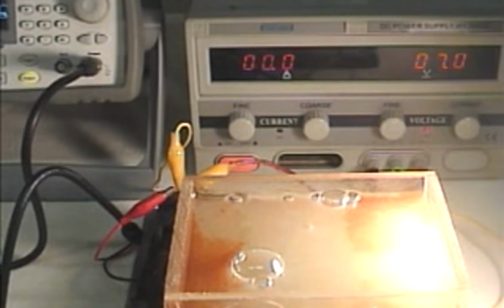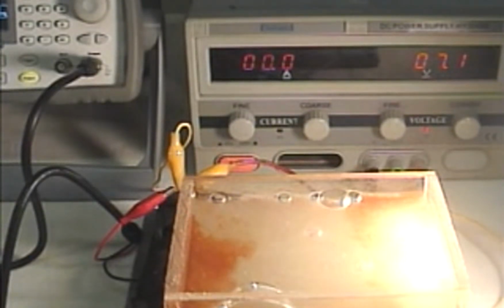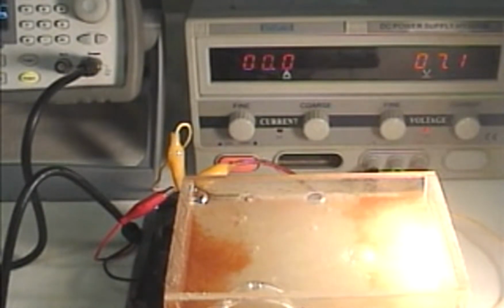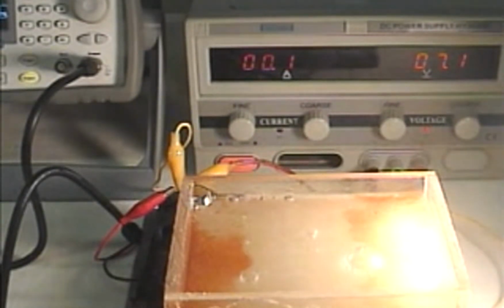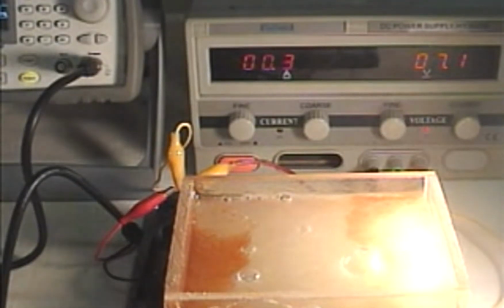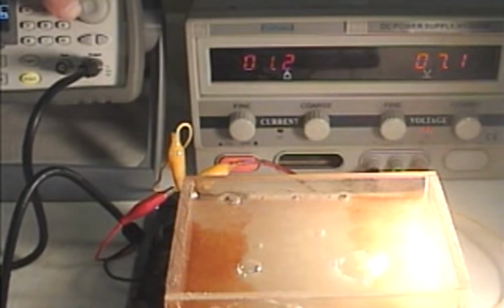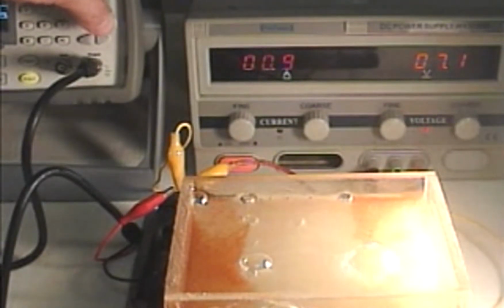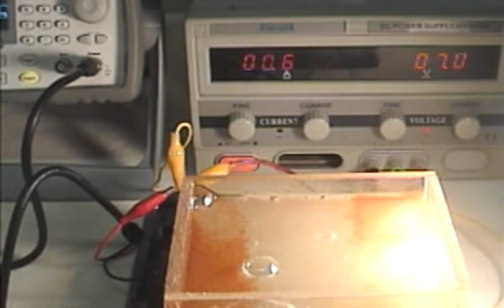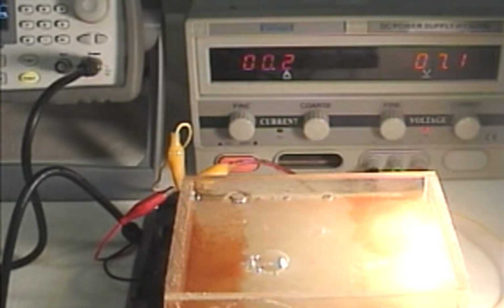These water tanks behave like a large capacitor, because essentially that's what they are, and the water is the dielectric. And obviously all capacitors have a resonant frequency, and so do these tanks. Here we go. 0.2, okay, turn the thumb wheel. That adjustment took it down to 1,000ths of a hertz.